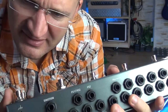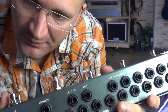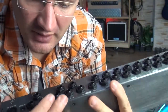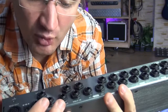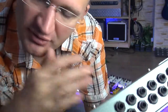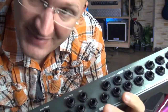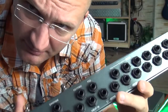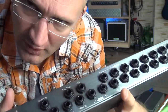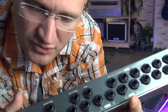The pedal is buffered. Buffering is generally a good idea to keep long cable runs from degrading your signal, and some people buy an extra buffer. Some pedals, like Boss tuners, have a buffer built in. I reviewed the Armor buffer from Dr. J, which is actually a nice one with built-in boost. But this has a buffer built in. So if you want to make sure all your impedance stuff, I don't know what that's about, is correct, go into the buffer in. But there are some pedals that don't like buffered signals, I heard. Like, I think wah-wah pedals, which would come before this anyway. Fuzz faces, I think, really don't like buffered signals. They just don't respond to them well.